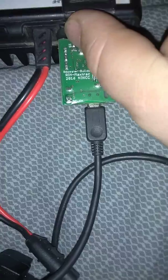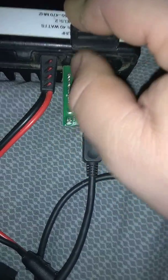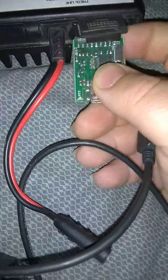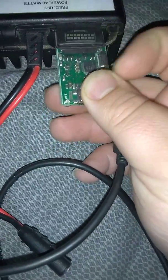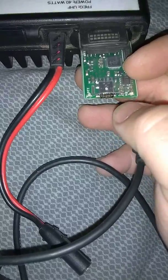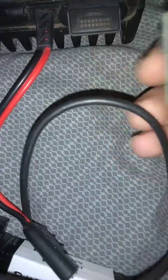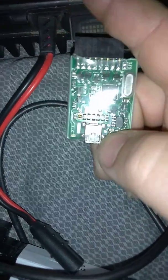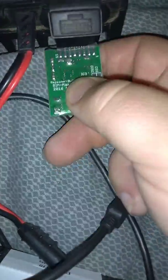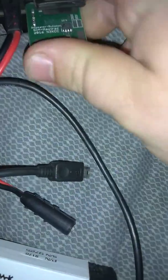You always want the little overhang toward your power outlet. On the MaxTracks, there's a big heat sink that rides right next to it, so when they plug it in it's pointing away from the radio. If you do it wrong, it will blow this radio quicker than snot — it'll blow the internal fuse. Once you blow the internal fuse and plug it back in the wrong way again, you'll wind up with a divot in the heat shrink tubing and something on that side will pop and make a big melt hole. Definitely make sure you plug this in the right way the first time.